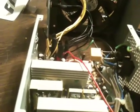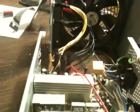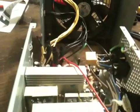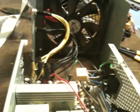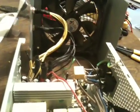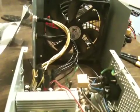With this 300-watt power supply, I'm getting 12.4 volts on the 12-volt line with no load. That may dip a little when I put a charger on it, but I'm hoping it'll settle around 12 volts, which is pretty much ideal. I know a lot of guys suggest that if you're going to do a lot with the hobby, you need a power supply that puts out at least 15 volts, but 12 volts has always worked for my particular RC charger application.